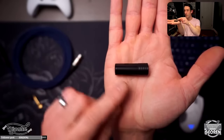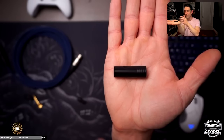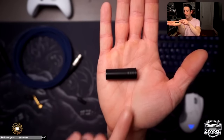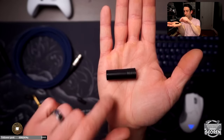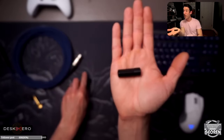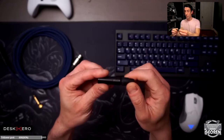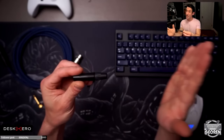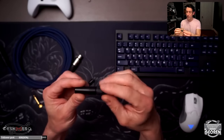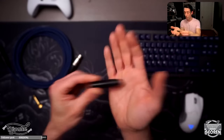Just enough, so you can see this is tapered out just a bit. So it pushes it further into the housing, allowing this wider back part to not be filled with the backside of the collet. It allows it to be open. And then what that means is when this collet nut screws into the back, it has enough clearance to go in that much further. And then it's socketed perfectly closed.